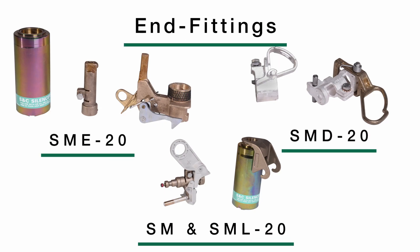Note that appropriate end fittings must be attached to the fuse unit before it can be installed in a mounting. While the SMU20 fuse unit can be installed in each of the mountings, the end fittings for use in an SMD20 mounting are dissimilar and not interchangeable with the end fittings for use in SM20 or SML20 mountings. Moreover, end fittings for use in an SME20 mounting are not interchangeable with the end fittings for SMD20, SM20, or SML20 mountings.